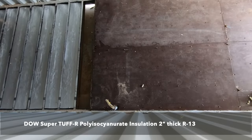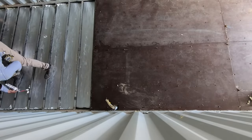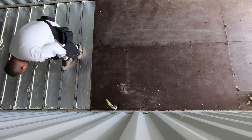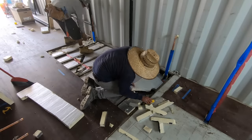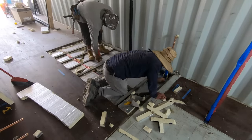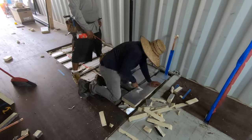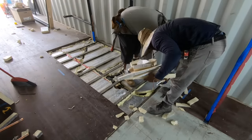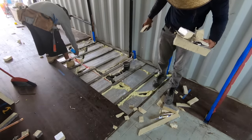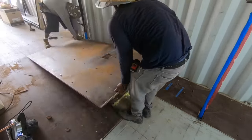In the floor areas that don't have pipes we started filling in with rigid insulation — two layers of two-inch thick rigid insulation sealed with spray foam. Even though this has an excellent R-value, it's not going to be super effective here because the conductivity of the metal creates a thermal bridge around it. We added it anyway to keep the space full, keep critters out, and provide a little extra thermal protection. After sealing it all and testing the pipes are watertight, we put the floorboards back on. We'll show the full insulation details including continuous insulation over this plywood in next week's episode.